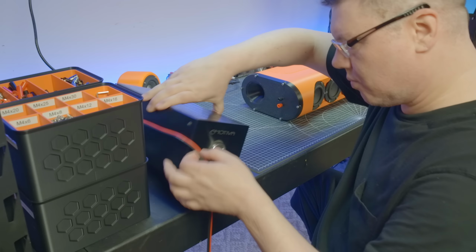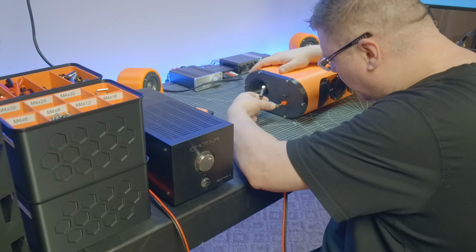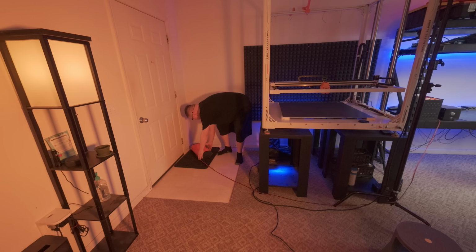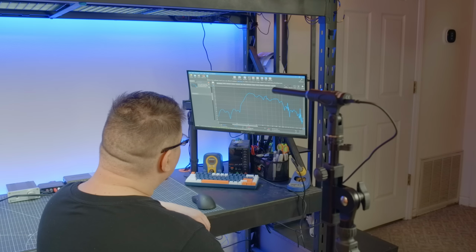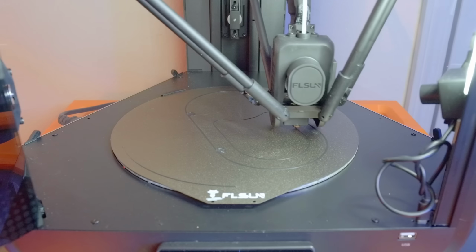To power it, I have this early 2000s era Class AB amplifier from Emotiva, delivering somewhere around 100 watts. The DSP is cleared out save for a 100Hz low-pass filter, and the sub goes into a corner, as that is also how I modeled it. The response is dead on. In fact, the only thing that I'm inclined to add is a 30Hz high-pass filter,